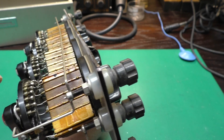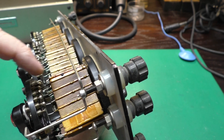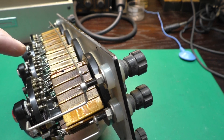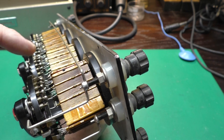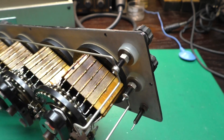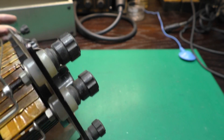I did a lot of research on rewinding these. One problem is getting the right wire — it's not nichrome wire, and the exact name is escaping me — but getting the proper type of wire and then having the skill to wrap it around there and being able to calibrate each resistance range separately. I would love to do that.